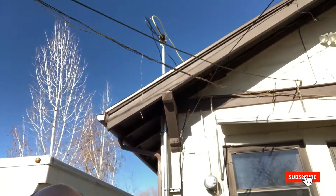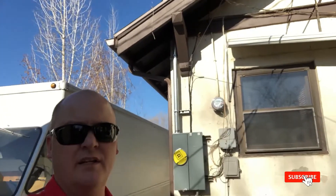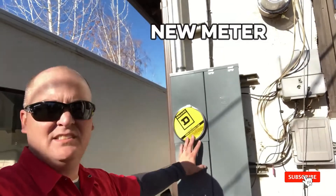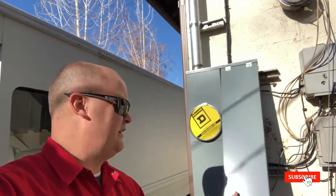We've decided to make a connection to that pole. So we went ahead and stayed with this location here. Did everything out of the grounding, did a whole new meter, went through the mast, the riser, everything. And we're going to cut over and get a nice big clearance across the yard. We've got the new meter in place, new main breaker, everything in place, ready to go.